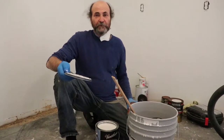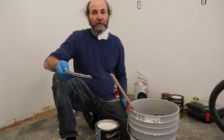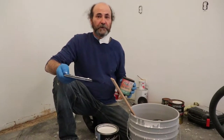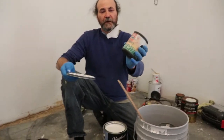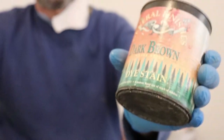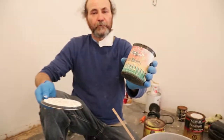Good as new. Now I'm going to prepare the varathane — I'm going to add a little bit of color to it because the floor is old and has some marks, so it helps to hide them a bit. I'm using a dye color, just a stain, and I put it inside the varathane.